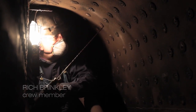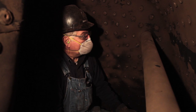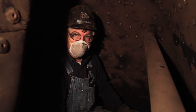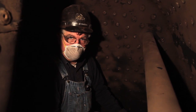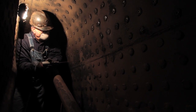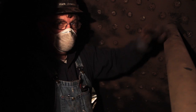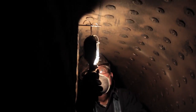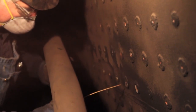Part of the annual inspection, every one of the stay bolts has to be drilled out in order to test for its continuity. This is a process that takes several weekends of just drilling in uncomfortable places. But it's necessary for the safe operation of the locomotive. Each one of these stay bolts has a drilled channel through the center of it.